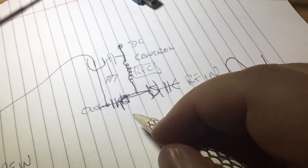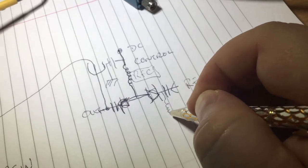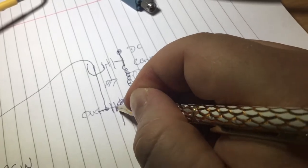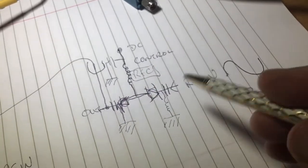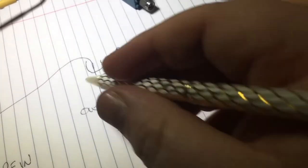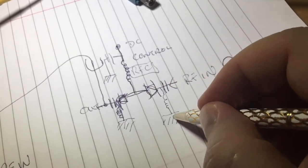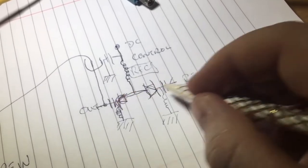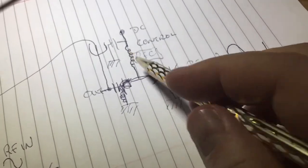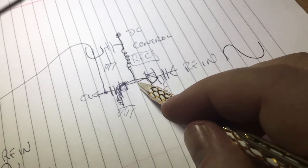On the outputs of these diodes to bias them, there's probably another RF choke to chassis which I can't see at this magnification — these are fractions of millimeters. So there's a DC path through the pin diodes to ground to provide the RF path through. If you look at how pin diodes work as switches, the transmit signal can only go through if there's a flow of DC current to ground through the diode.